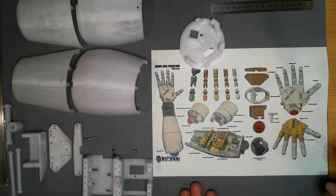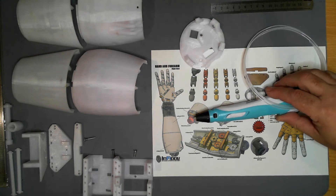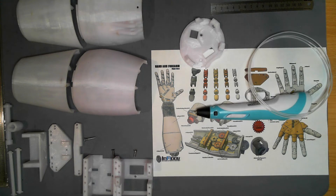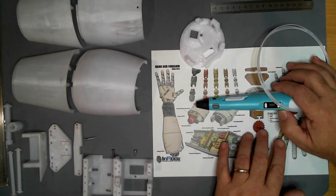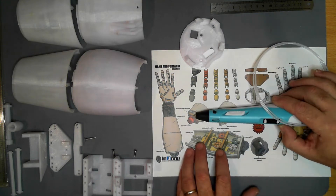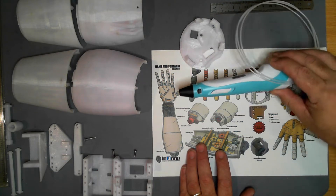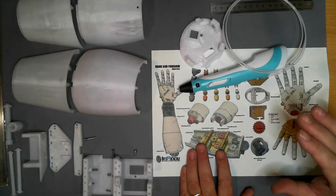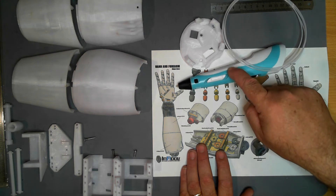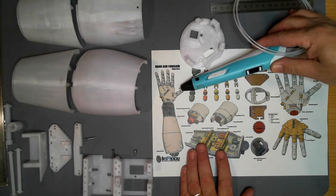I have been told that plastic welding on this will work, so I'm using my 3D pen again. I've loaded it with PETG filament — this pen's designed to run PLA or ABS, so I'm going to set it to the ABS settings. When printing PETG, I'm running at 235 degrees C. With PLA I've been printing at 205 and using the pen at 200, so I'll go 5 degrees lower and run the pen at 230 degrees.